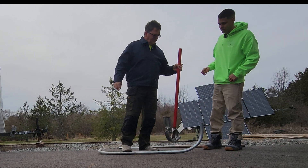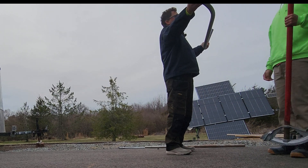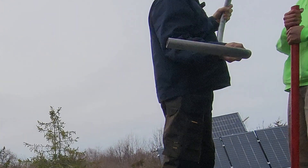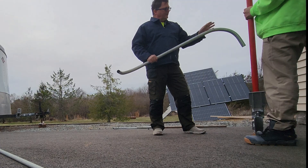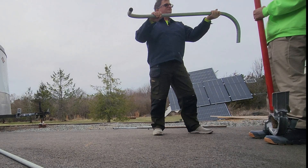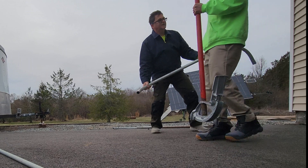That was my first 90 ever — inch and a quarter. Let's take a look at it. We've got our 90 this way, and it wasn't up — that's why I wanted to step on it and make sure it's square. You can see these little ripples; that's completely normal, a little bit kinked up from you bouncing on it, but that's certainly acceptable. If you want to do another 90 going up, you would use a stairwell. You need to get this level — on three-quarter or half inch you can do it in the air, but this you really need all your weight. So go find a stairwell, have this side go down the stairs so this can lay flat, and then continue with the bend.